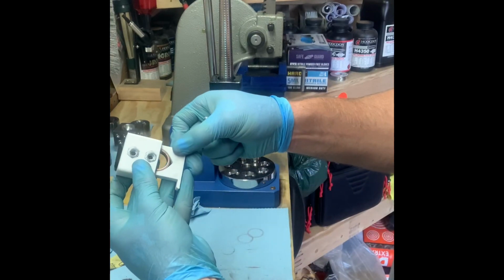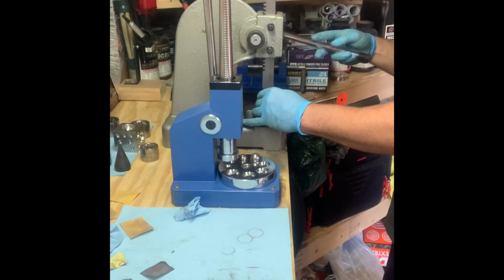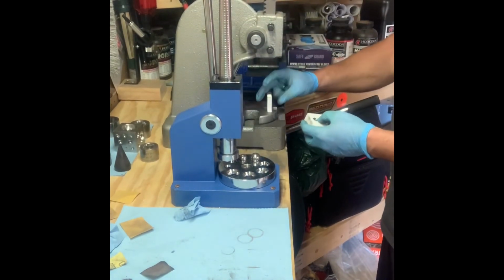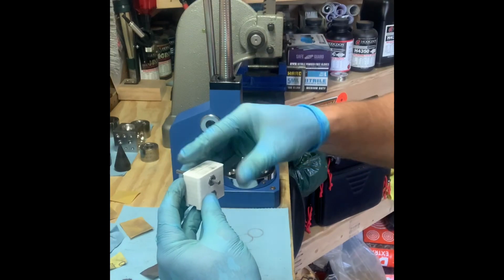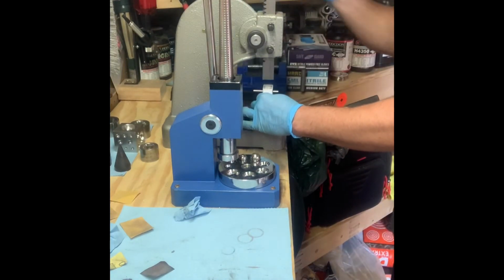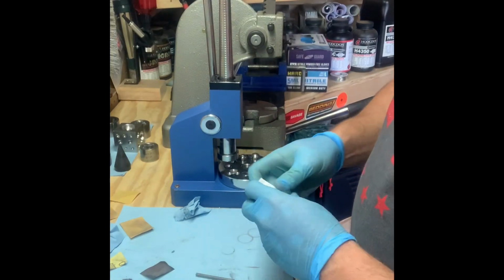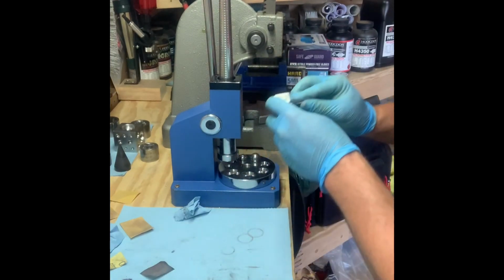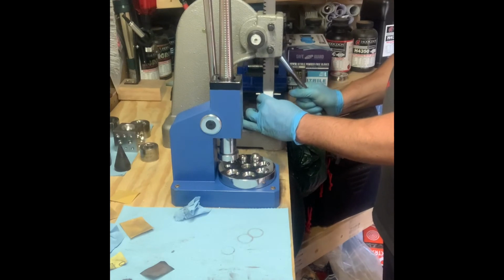All right, this jig works. Stick this through the coin, through the bottom hole first. And then your press. You're going to press it till it goes down to the bottom. When it comes out, you're going to have the bottom point of your heart, and then you do the same thing through the top hole. And this one you've got to kind of judge it, and I like to go a little bit, pull it out, take a look. Yeah, still got a ways to go. And just keep repeating that until you get to the point to where it's shaped like a heart.